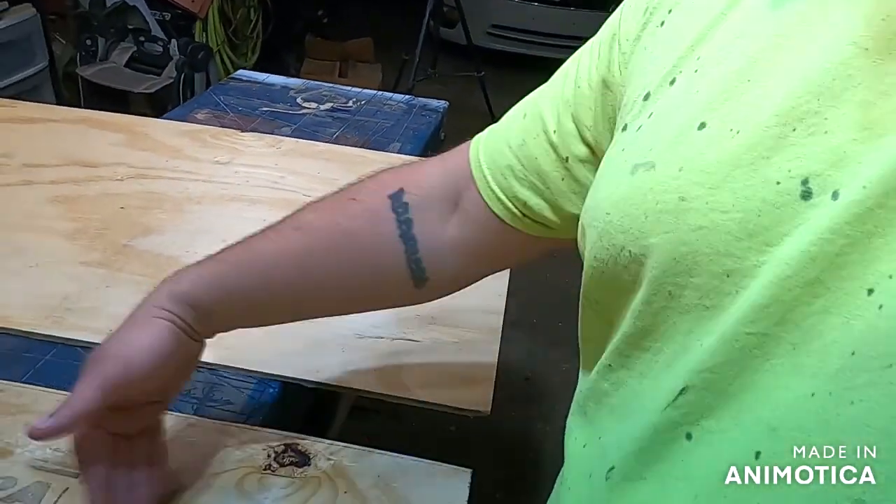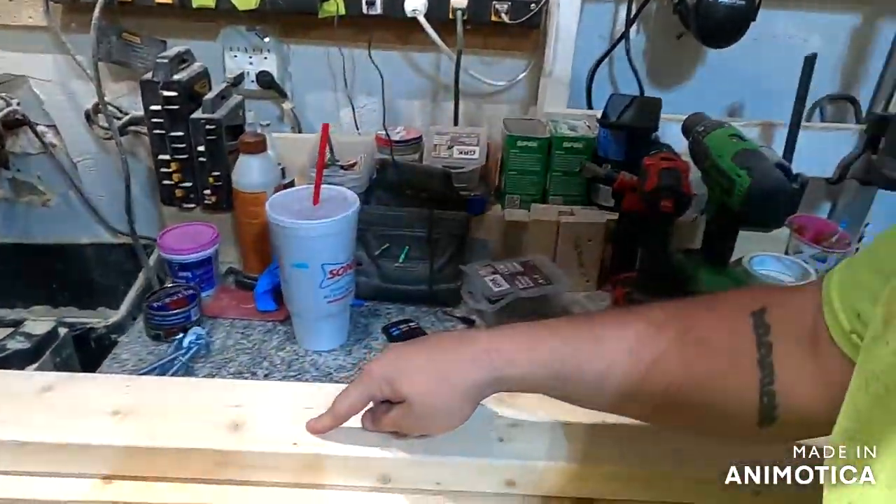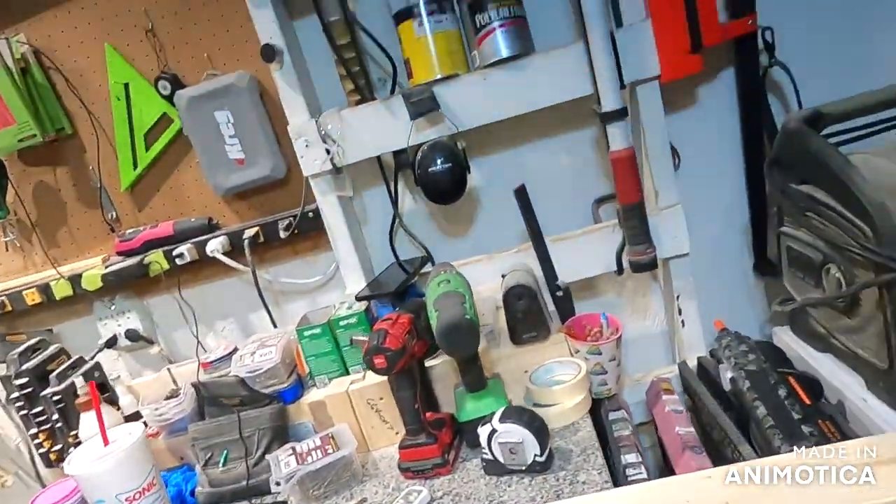Like I said, I cut them two foot by four foot and set them aside because I knew I'd need them again. The next thing you're gonna need is two 2x4x12s — these are 12-foot long. That is just enough wood; you'll have just a tiny bit of scraps left over. That will be the frame for your two boards.